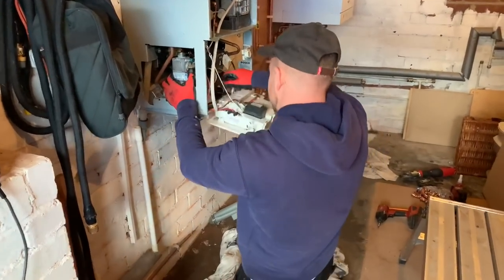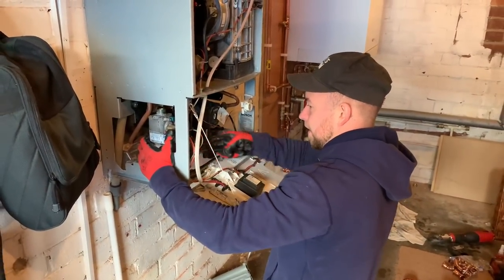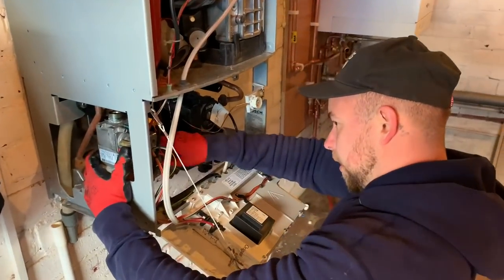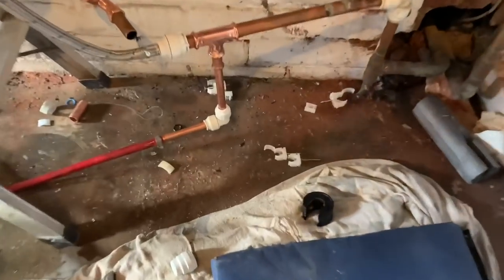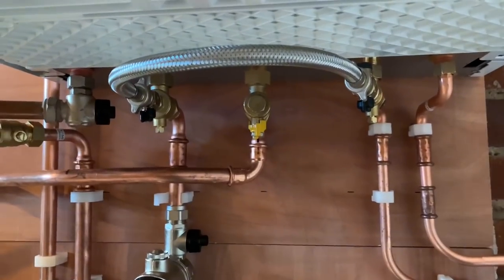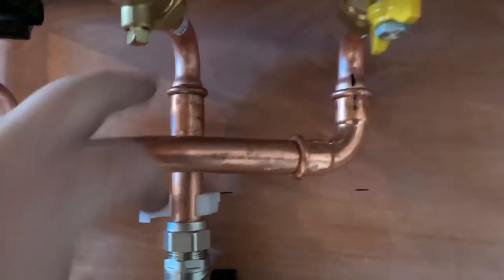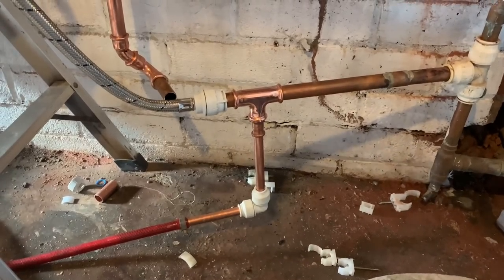Just so Danny can have a little bit of experience on boilers — he's stripping down the old Worcester Bosch, taking out the flow turbine adapter because that's a common thing that leaks, and taking the gas valve out, just to give him a bit of experience. Before we fill the boiler and let any water from the system go through it, I've rigged up a cold water feed going into the filling loop so it goes round the heating system — just doing a mains flush before we put any water through the boiler.